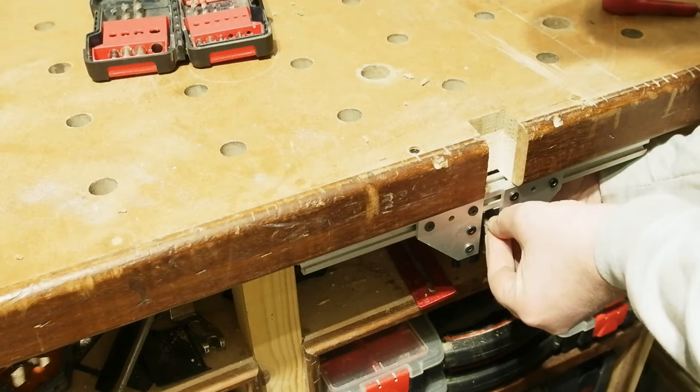The pin itself you could just as easily do the same with a piece of any T-track. My dial-in sheet is the same you may have seen me do before. With the pin set to height and its mount loosened off, I fix the guide rail square to the rail, flush it to the fence, then clamp it. With that set I can lock the rail down square, then back to the pin — slot it in place and tighten down. I double check everything with some other squares — no unwanted wiggles detected.